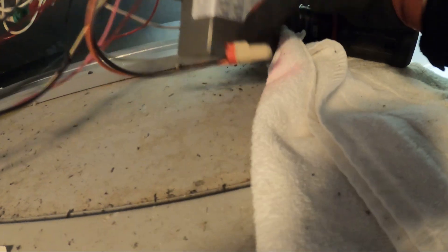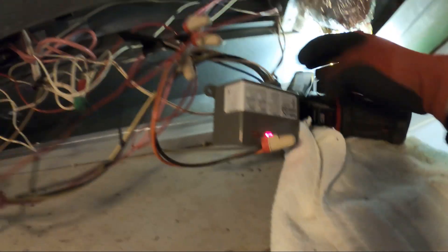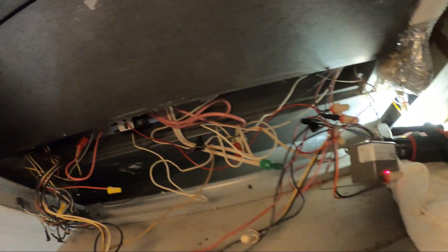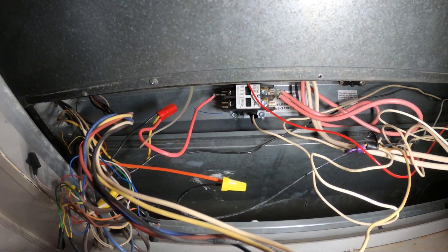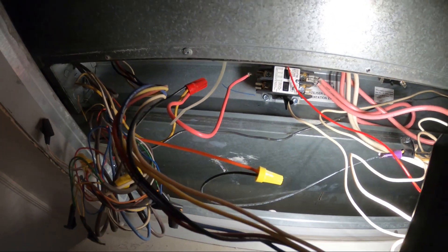We're set to heat. There's one light on here. It's pretty chilly in here. The actuator is up there — I can feel the stem and it is closed. So it looks like the relay is calling. Those are going to be the electrical heater wires right there. Instead of a relay, they put a contact in here.